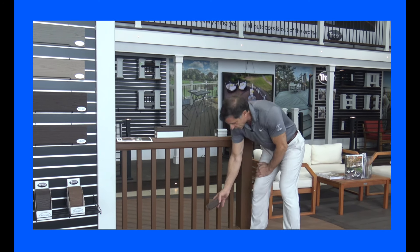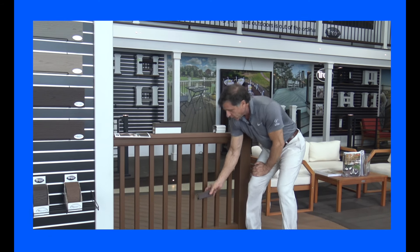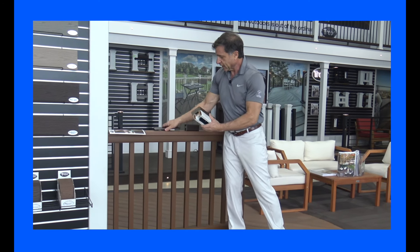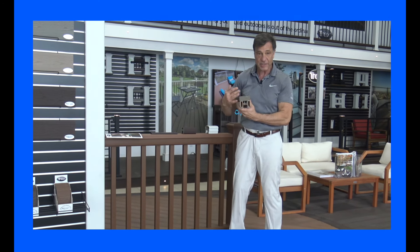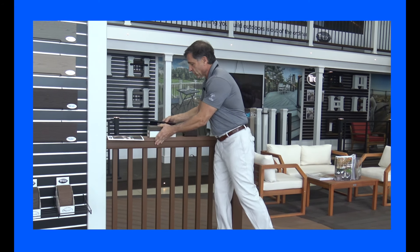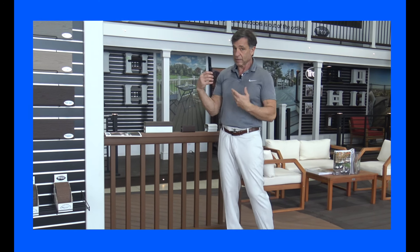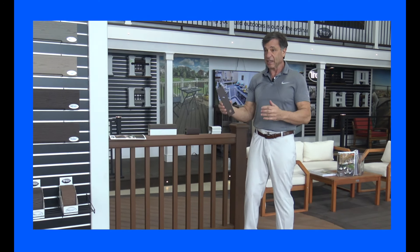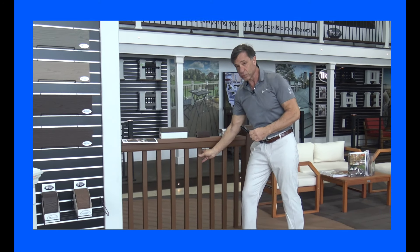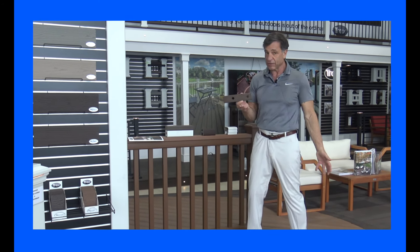On the bottom here we have the standard universal top and bottom rail. You bring it up to the top, turn it over. Or you can affix a 2x4 on top or a piece of decking to go over the top of the posts. Then you use the infill kits. This is what makes the whole rail as flexible as it is. Someone at Trex had the forward thinking to see that not all rails were going to have square composite balusters — you just change the infill.